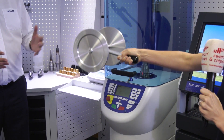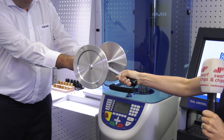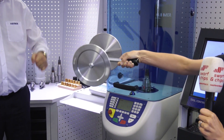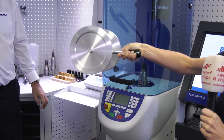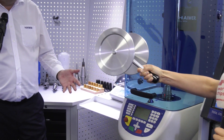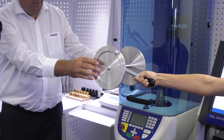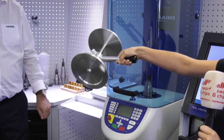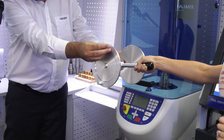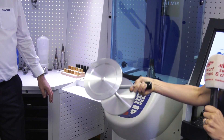This is a balanced flywheel representing the machine spindle - you can feel if you rotate it, it's fairly easy to move. Now we'll create a little bit of unbalance by moving the weight, and spin it - you can feel a direct resistance; the weight distribution is off center. This is running maybe three to four hundred revs, so you can imagine with twenty thousand what happens. If you oppose the weight and put one opposite it should correct it - actually it makes it worse. Take this weight and oppose it here - now you can see it's completely balanced.